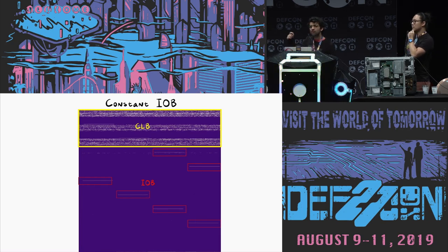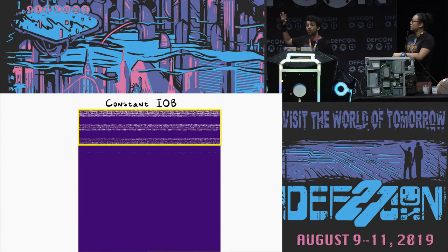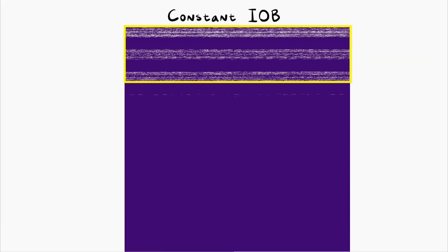And if you change a little bit in this, like a byte here, you can change the value of the logic of the IOB from 0 to 1 or 1 to 0. These 8 bytes also represent the characteristics of this IOB, so you can convert it from input to output. By just changing one parameter, the number of rounds in the SHA-256, look at the logic changing, but the IOB remains the same. And this is the diff. The only diff was actually in the complex logic block. It was not there in the IOB. And this is very important.